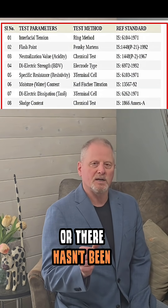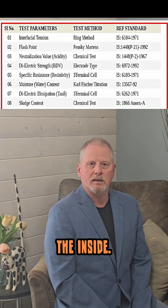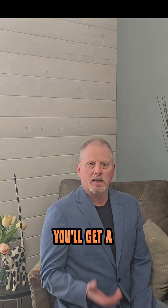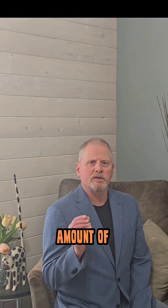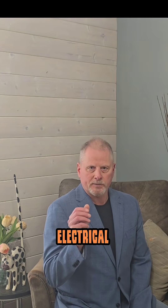The second problem is there's been no effective way to tell exactly what kind of damage occurs on the inside. Typically what happens is you'll get a small discharge when the paper breaks down — it sparks between the copper windings on the inside.